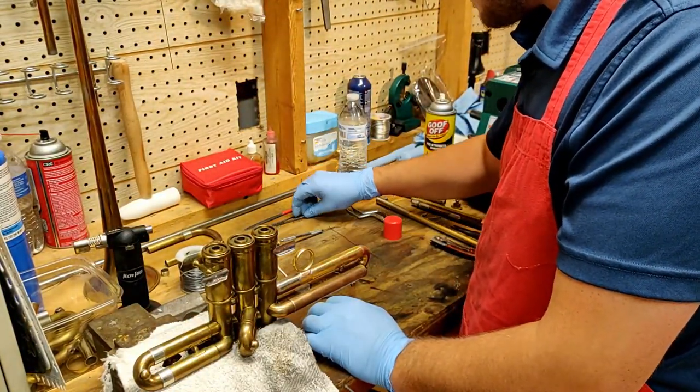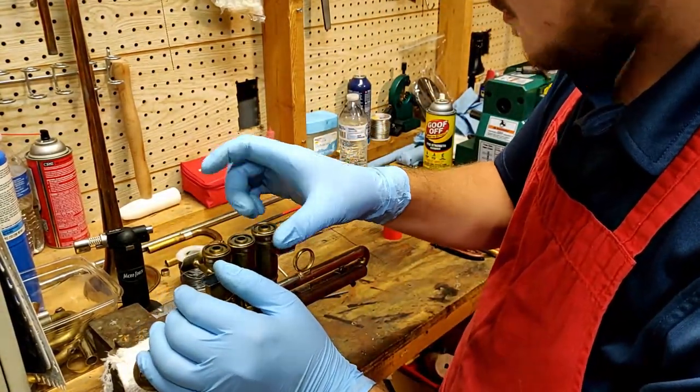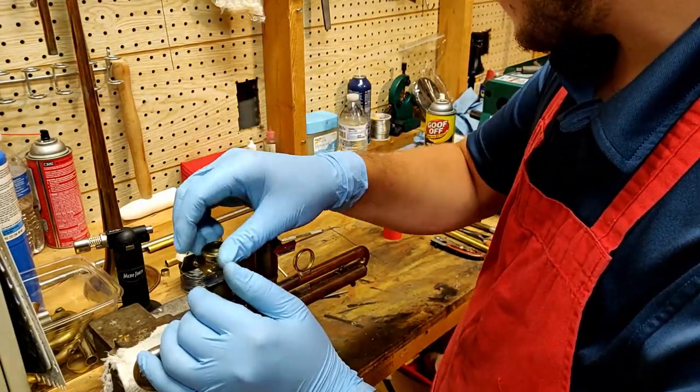For this joint I only need about a centimeter or two of solder to make sure that it doesn't overflow. Now I'm starting what will turn out to be quite a long filing process, but I need to remove the valve caps first so that I don't accidentally nick them when I'm filing so close.